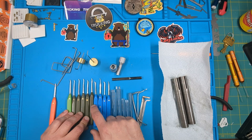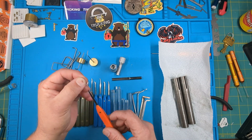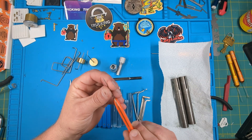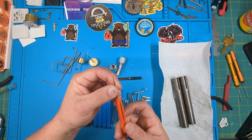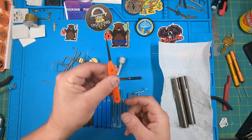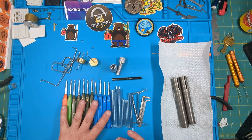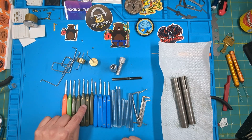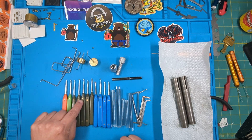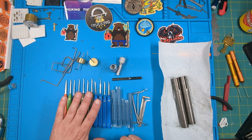There's another monkey paw copy, a gem two low hook, and then I made my own bypass knife - I can't remember if it's 25 or 30 thousandths. I made my own little bypass knife and cut all the handle material. I was having issues with the epoxy, so I started drilling and adding brass rods, making rivets out of them, which is one of the fun aspects of lock picking.